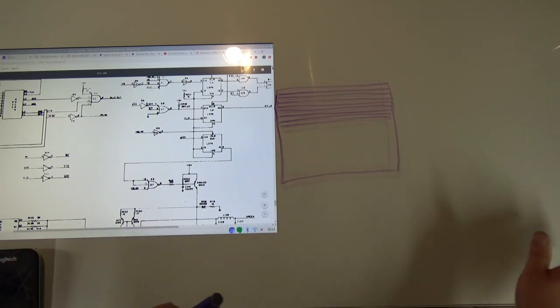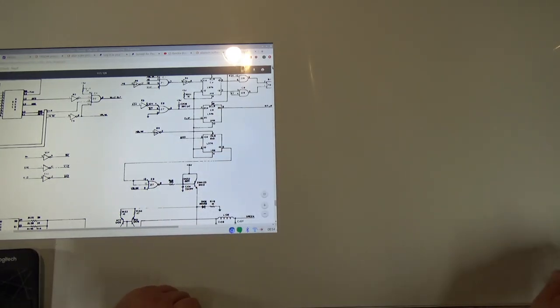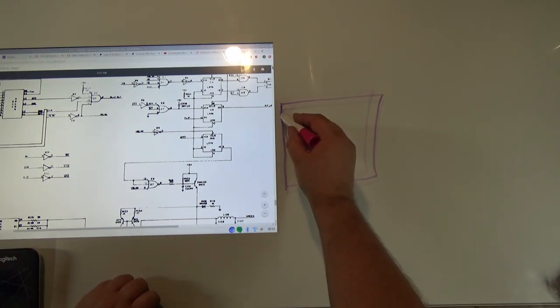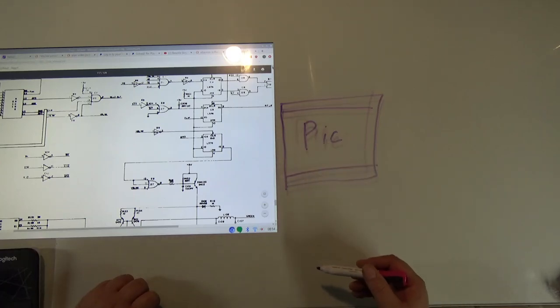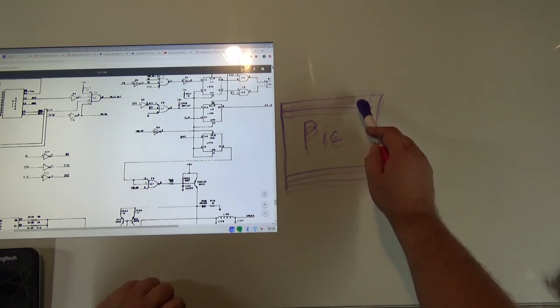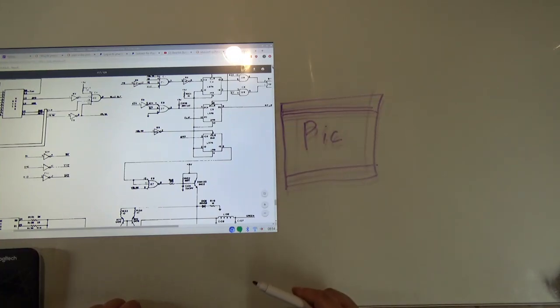So if we remove that first line of garbage, we get rid of the noise. There's no existing signal that fires just after v-blank, so we need to make our own. The v-blank signal blanks the upper and lower portions of the screen — the picture sits in between. If we hijack that blank signal and make it slightly longer, we can cut off the first one or two lines of the picture.